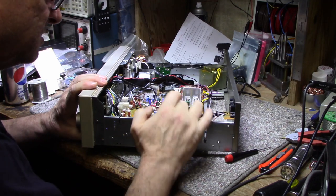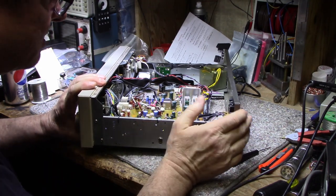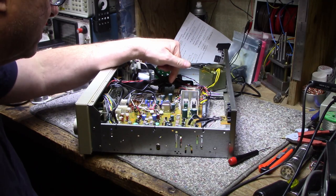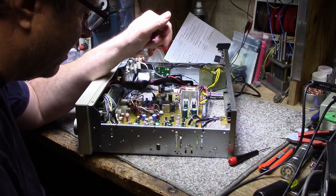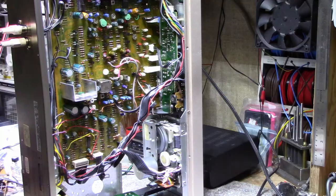These are some TK capacitors that I'm not pleased to see, and I can see a bit of circuit glue around some of the bigger ones. I'll start cleaning that up and do some ESR tests to make sure all the caps on this board are good, and we're not going to have any duds that are going to upset any circuitry.